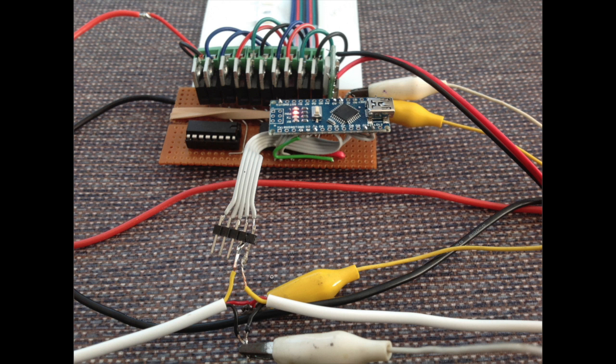The testing, we've connected the PIR, the sensor line, to the pin, and there as well we've got the yellow wire is the live from the 5 volt, and the white one is the negative to the 5 volt. So that's all looking good, nicely lit up.